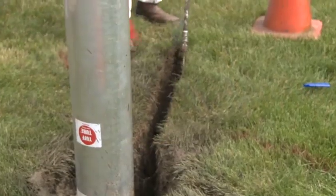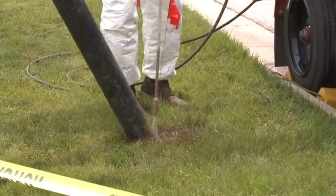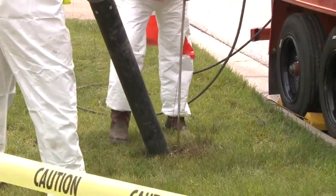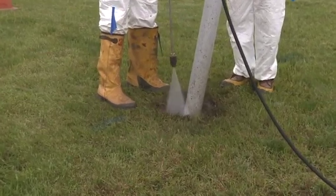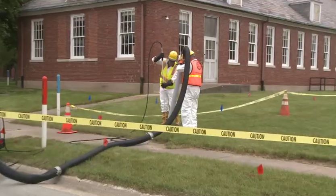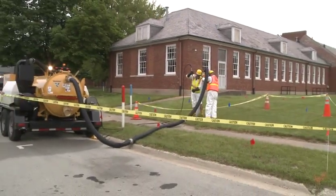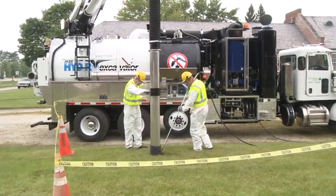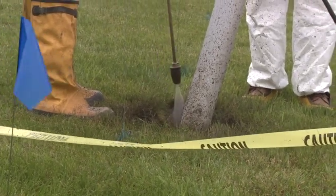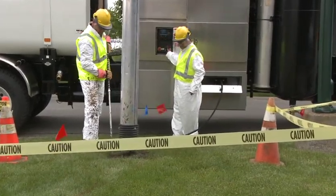Site conditions may make the use of hand tools to expose underground facilities difficult or impractical. Vacuum excavation, when used properly, is an efficient, safe, and effective alternative to hand digging within the designated underground facility tolerance zone. However, many underground facility owners and operators have specific criteria for safe excavation and exposure practices around their facilities. When exposing utilities, the equipment should only be operated by a worker trained and experienced in its operation. They must be familiar with the practices which provide appropriate levels of worker and public safety, and should know the proper procedures to prevent damage to buried facilities.